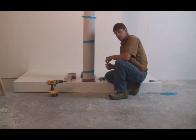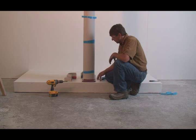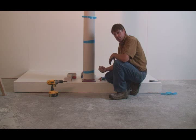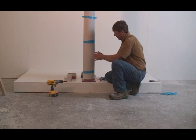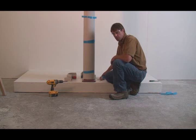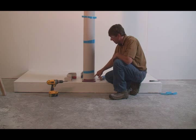While the adhesive on the parting line is curing, we're going to get the column in position at the bottom by lining up with the marks we made on the ground, then using the cleats that come with the split fit system. We're going to secure those into place using the supplied Tapcon screws. To keep the column from turning left to right, I've used the Dap polyurethane adhesive that comes in the split fit kit and applied it between the cleat and the column.